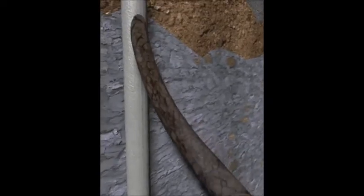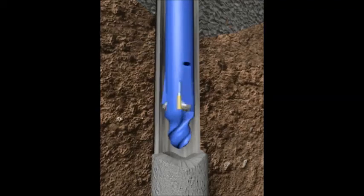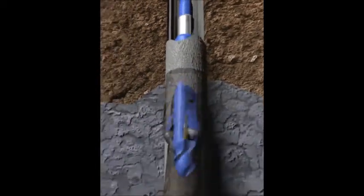The drilling BHA is then pulled out of the hole. For under-reaming applications, the lock-o-matic can be dressed with any type of roller cone, PDC, or bear claw cutters. The cutout into the formation is then made and under-reaming is begun.